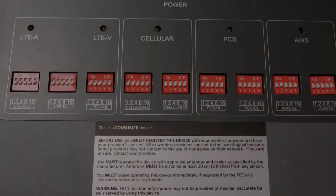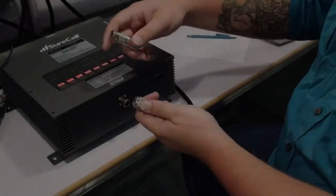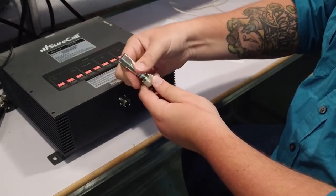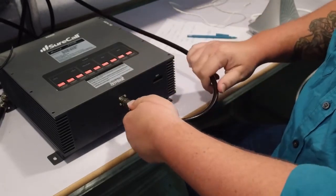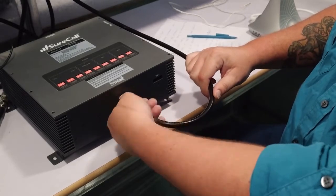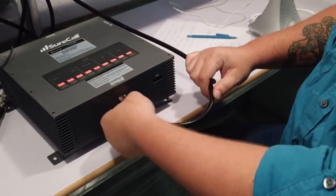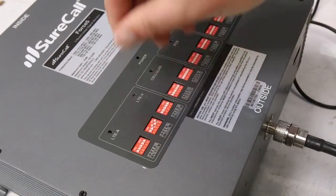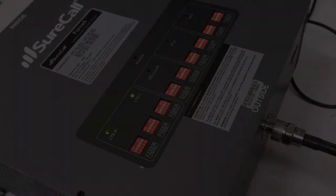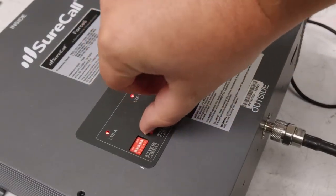Here's a quick guide to get you going in the right direction. If you see red lights flashing on three or more bands, you should consider using an inline attenuator — however, make sure you check the bands that are not flashing to ensure you have enough signal to accommodate the signal reduction. If you see only one or two bands flashing red, attenuate the downlink on the manual gain controls of those bands. Start with 16 dB, do a power cycle, and if the red flashing light is still being activated, add more attenuation. Remember, putting all of the manual gain controls into the on position will shut the band off completely.